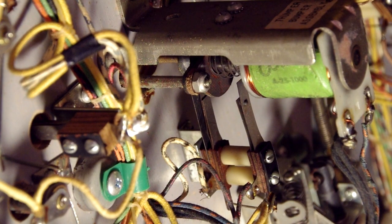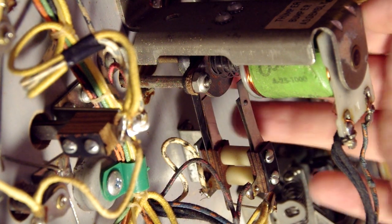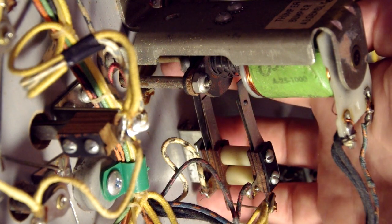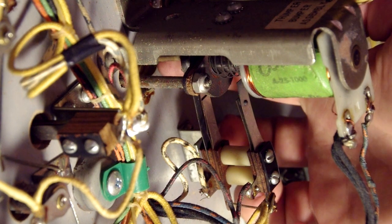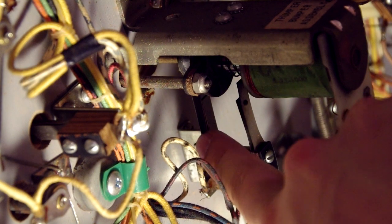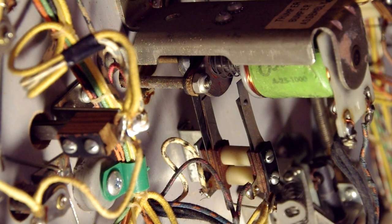To give a better view of the pop bumper assembly I've removed the playfield from the machine. The way the pop bumper assembly works is when the skirt is touched by the ball it causes this switch here to move down. When this switch gets closed it actually energizes the pop bumper relay. The purpose of the pop bumper relay is so that the switch doesn't have to carry so much power through it — because not only does it have to move the pop bumper down, but it also has to score points. Therefore you have a lot of functions that need to happen at one time, which is why it's gone through a relay.